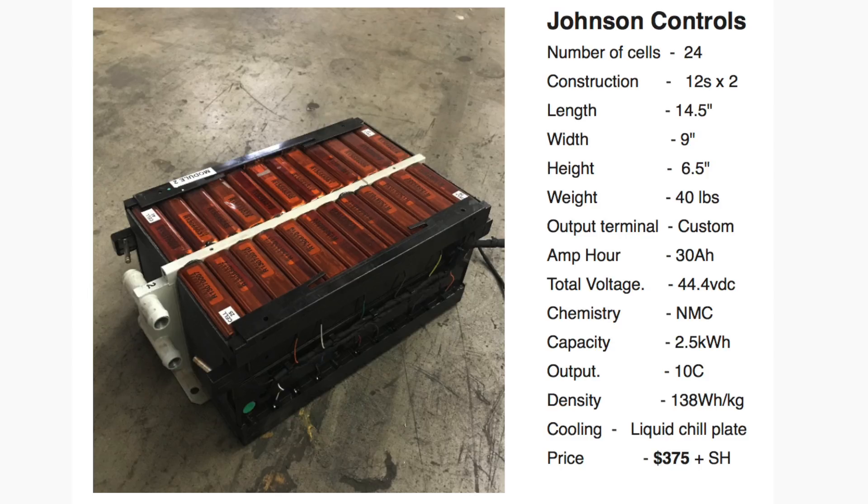You also don't have to stick with the 12S configuration — you can remove cells from one side or undo the packs and set them up differently for 13S, 14S, 15S, 20S, or 30S. If I were putting these in my bus, I'd do a 30S and then several strings in parallel — essentially the same thing I have now with the Tesla modules. These are really good. They come in a module that's 48 volts, and you can connect both sides to make 96 volts. These sell for $375 plus shipping, with a minimum order quantity. It all works out to the same $150 per kilowatt hour — great price, great batteries.